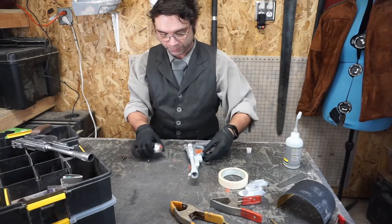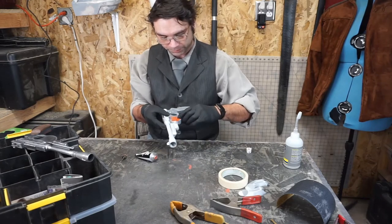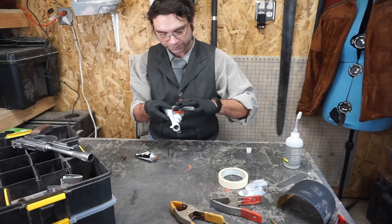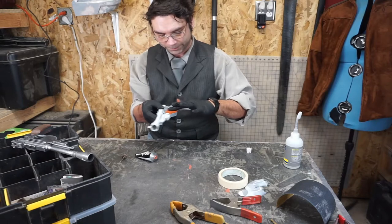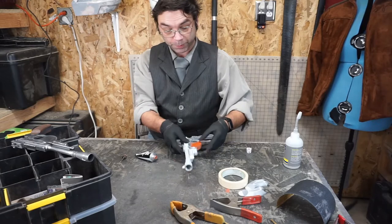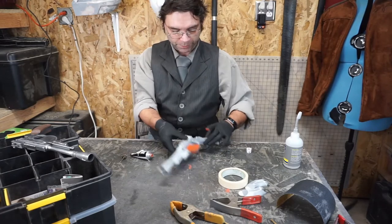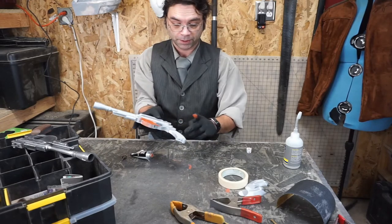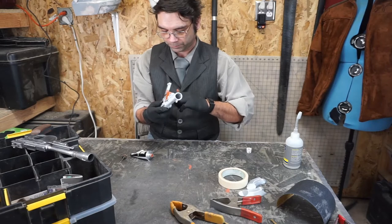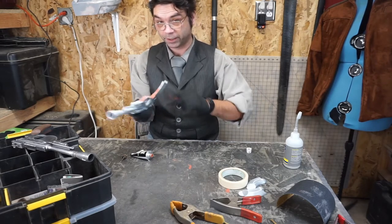We're gonna give it a light sanding when we're done, and might do a second coat, might not. We'll wait and see. So what we want to do is everywhere that's exposed needs a glazing putty. I'm not going to worry about here because this gets covered with the scales. Other than that, we just apply a lot of glazing putty.